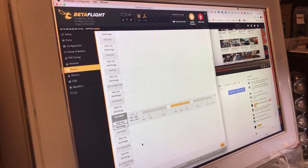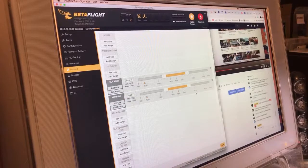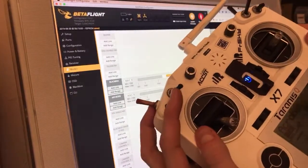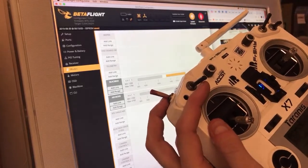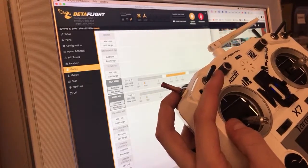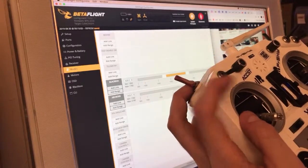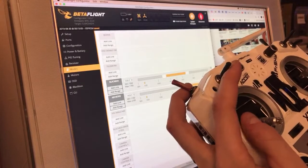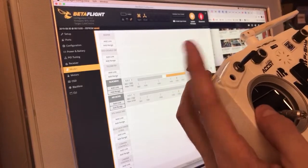I talked about not permanently enabling air mode. Where the hell is air mode? There it is. I put air mode on that same switch, and I only put it down the bottom of the switch. Because I always fly with this all the way down, which is acro, no horizon, I also have it all the way down with air mode, because that's the way that I fly. So if I want to perch on something, I can flip up to the middle, and that turns air mode off. I can even flip all the way up if I want to. That's also air mode off, and it'll level itself, which I've never actually tried. I've only ever gone one up. But yeah, it gives me a bunch of different functionality on this one switch that otherwise we don't really use much. So I have like an oh shit, I have turn air mode off to perch on something, or just, you know, whatever. There's weirdo situations where you want to turn air mode off.